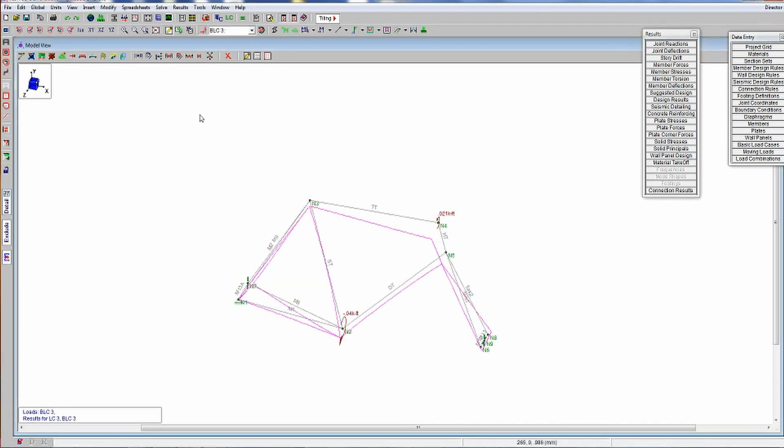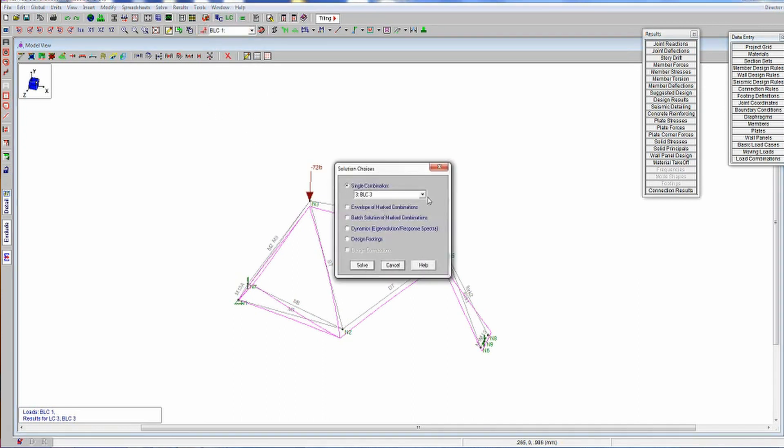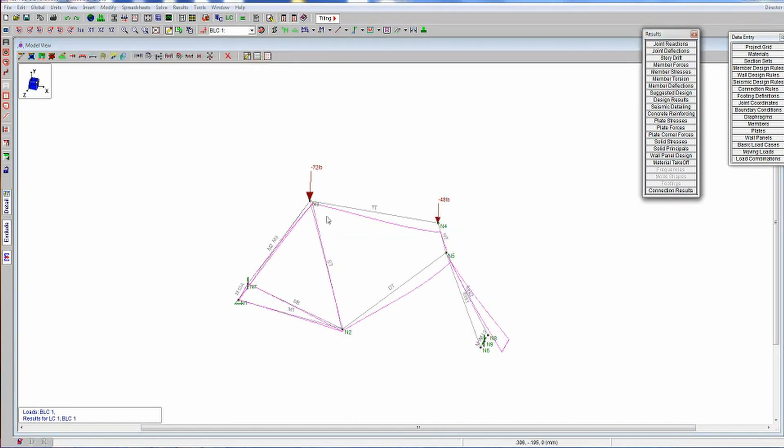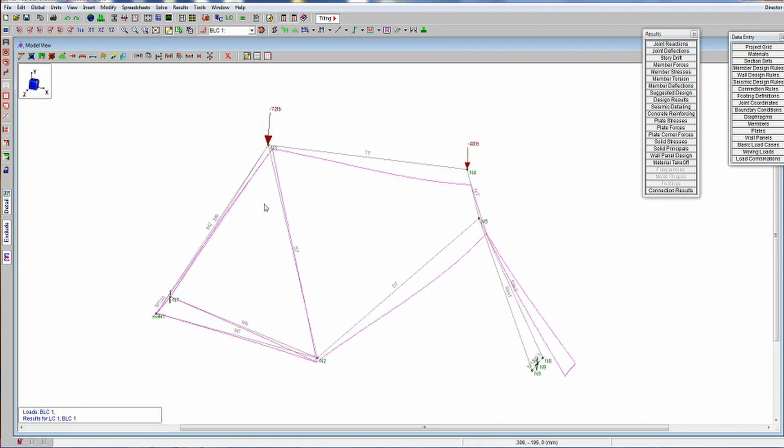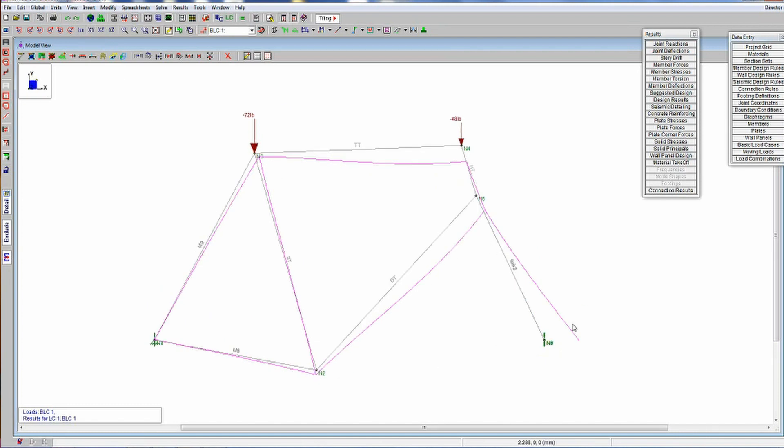So that's that case. Let's look at this other case — here's the vertical load case. If we bend this frame vertically — we just sit on it — here's your vertical load displacement diagram. This one is really interesting because it shows how much the bottom bracket moves and how much the fork bends, as well as the front triangle. It shows you how much curvature and bending there is in the front end of the bike and how little displacement is happening in the rear triangle. A lot of people have said that bikes are very stiff vertically, and they are, but with a nice flexible fork, flexible tubes, and a long head tube, you actually get a lot more displacement and compliance in the front end.